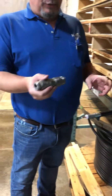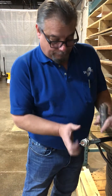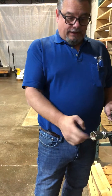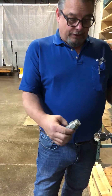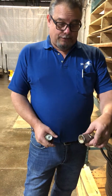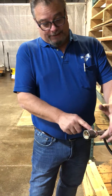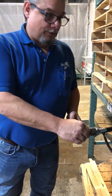In your connector there are little jaws that clamp on there, and if you have dielectric in there it won't make a good connection. This is the straight splice we would use in an underground repair. Put the back nut on, then the second nut. Before you put all this together, get the back nut started a couple threads — no more than that. If you tighten the two down first, you'll never get the back nut started. If you tighten it too much it won't turn on, because the back nut clamps the cable and the second nut clamps the center connector.